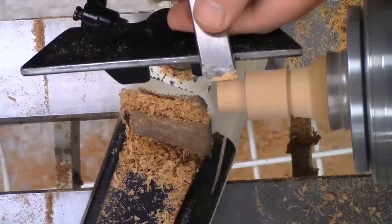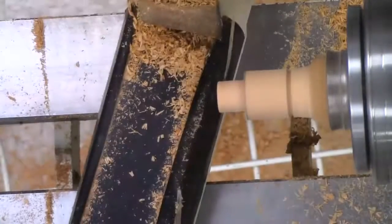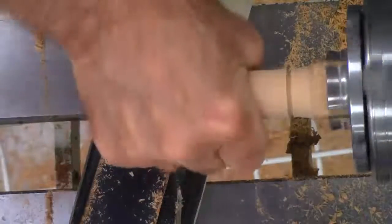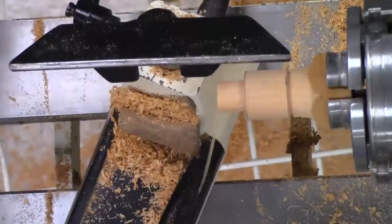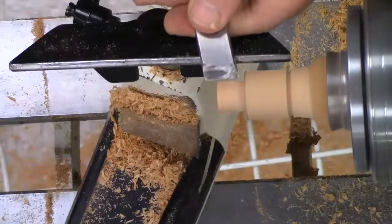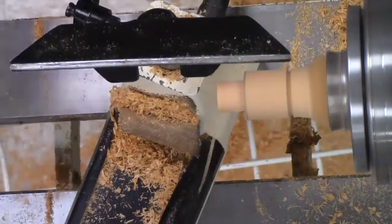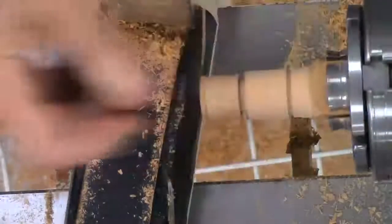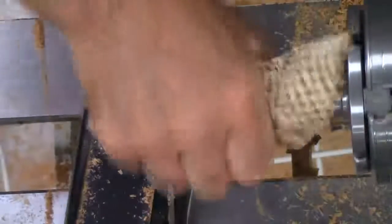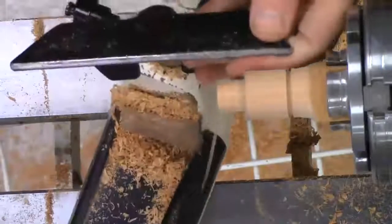So I'm working on the back side. The front side fits about halfway, so I don't want to loosen that up any. I'm just getting rid of a little bit of dust is all I'm doing. And I'm taking my time to get a nice fit, because you hate to make a box with a sloppy fit on a pillbox where they're going to carry it in their purse or their pocket. The top does need to stay on. Sometimes by doing this, you can see the burnish marks, so you know where you need to kind of take it off.